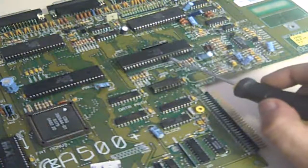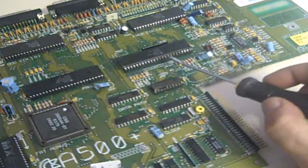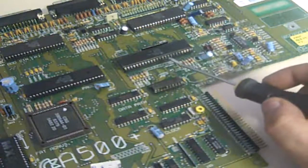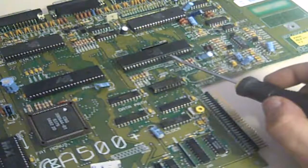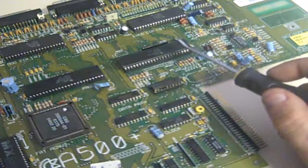The remnants of the legs stuck in the holes - the solder had turned into a crystalline substance. It just wasn't solder anymore. No matter how much solder I added to it, it just wasn't amenable to desoldering. So what I did - and this is a bit of a risky move - you need a very steady hand.